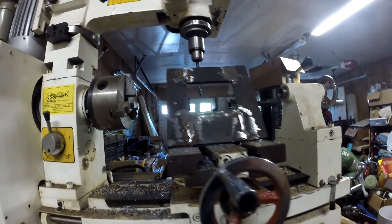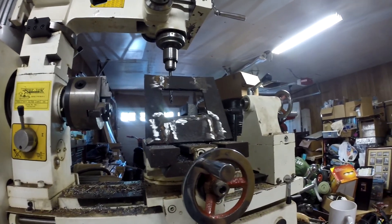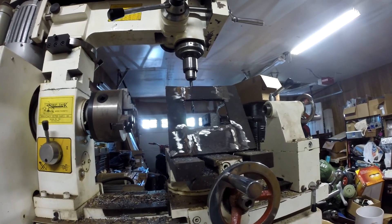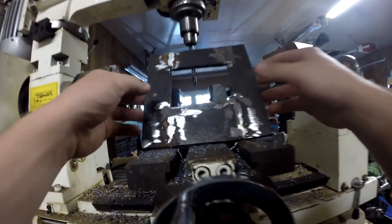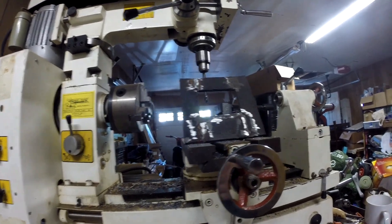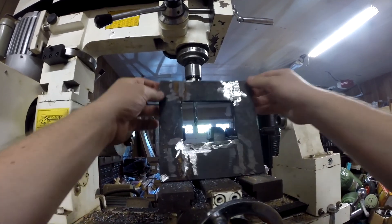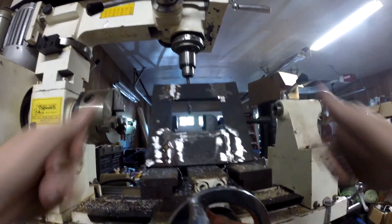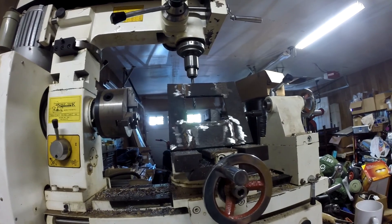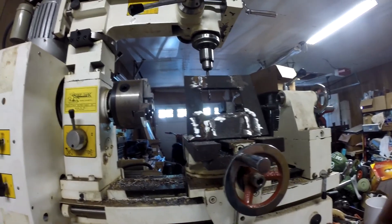The whole reason behind doing that is because the engine has no mounting holes for a torque converter or anything. So that's what we're going to have to do. I think this will fit in this thing — I'm not totally sure — but either way we'll find a way. I could clamp this bearing plate right here to it, so that'll work. What I need to do is take the torque converter, draw where I want the holes, and then start drilling them. So we'll get right to it.